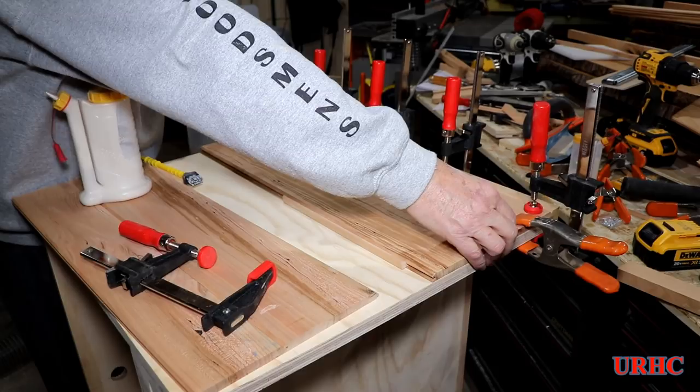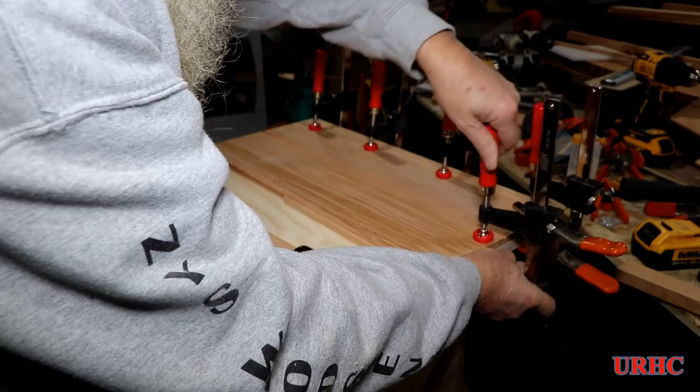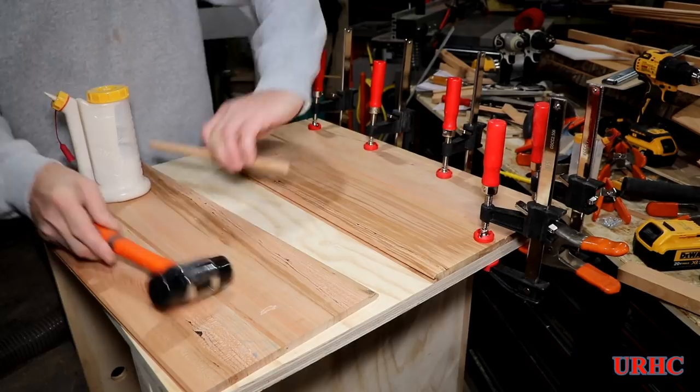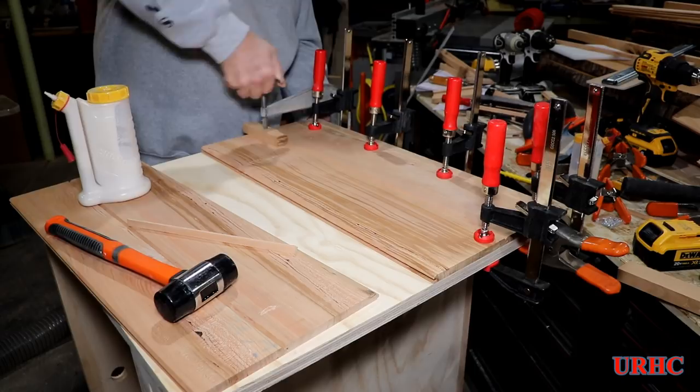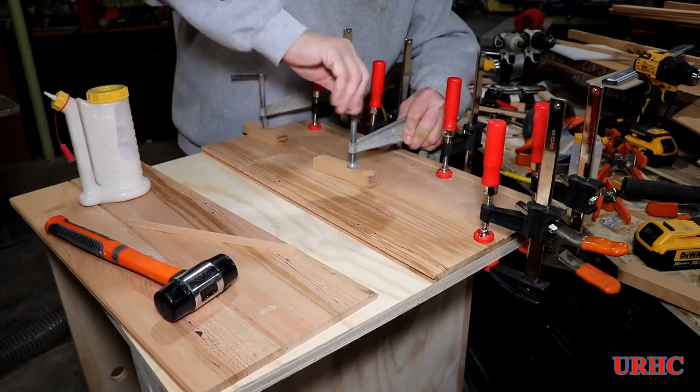These are the pieces that were resawn off the actual top when I prepared those pieces, so I'm trying to get the grain to go right around the edge — you'll see that once it's all together. I'm gluing one side and clamping them down for a couple minutes to make sure the glue is squeezed out flat with no lumps underneath. It's nice having a couple of these deep-throat clamps around for times when you can't get in there and clamp things any other way.